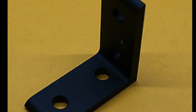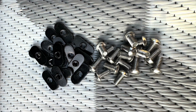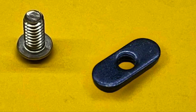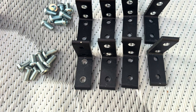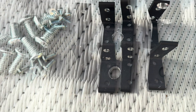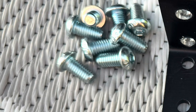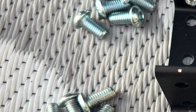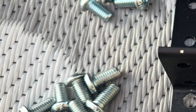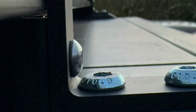You'll need 8 inside corner brackets. I ordered 16 sets of quarter 20 button head screws with the T-nuts — I got the stainless steel for strength. I modified each of the brackets by drilling two of the holes to a larger diameter to accommodate for the larger screw to mount to the top of the SmartCap. The 16 screws are M8 16mm length button head screws. I had to modify half of them by grinding down the top in order to accommodate for both screws that go into the corner of the bracket.